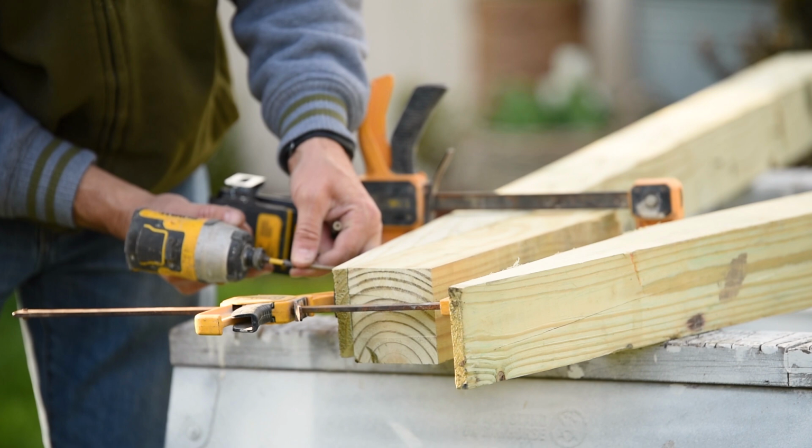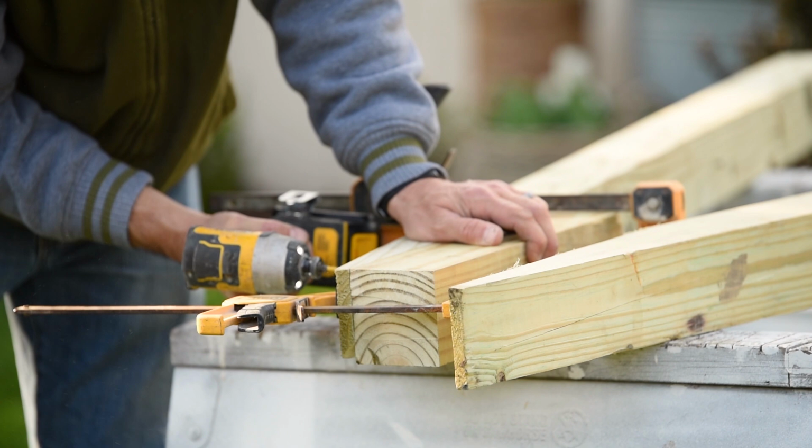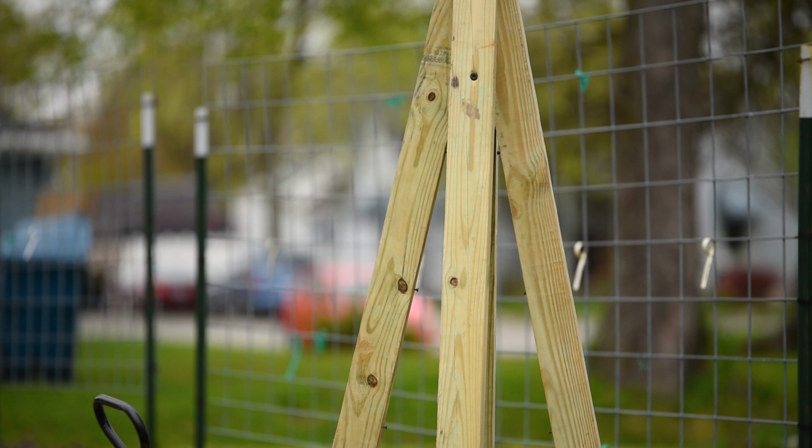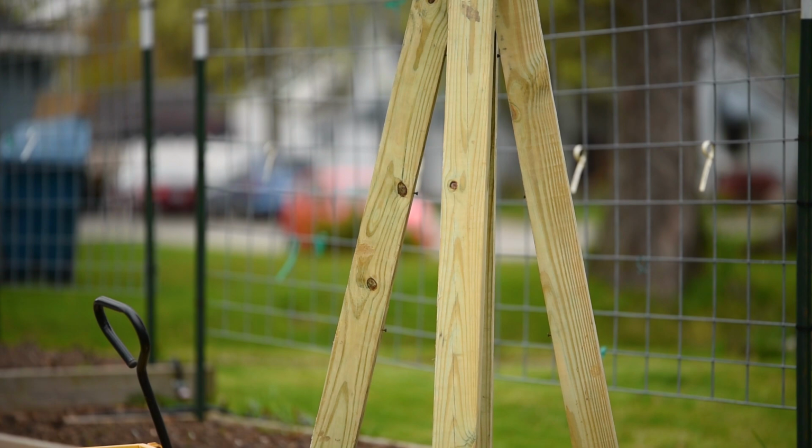When you do a plunge cut with a circular saw on treated lumber, it almost never comes out perfectly because treated lumber has between 60 and 70% moisture content. So literally when you run a big screw in it, you'll see water gush out because of that moisture content. And you know, it's nominally 3.5 inches by 3.5 inches for a 4x4.